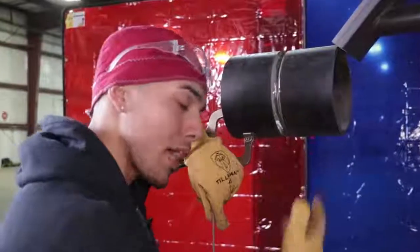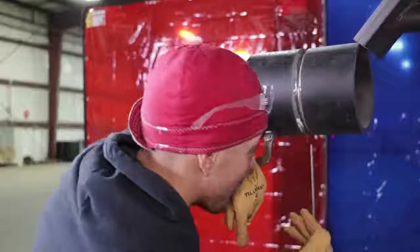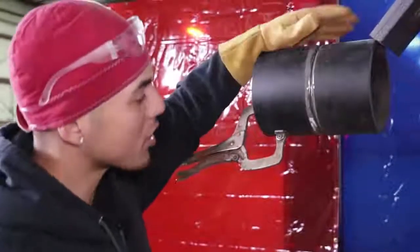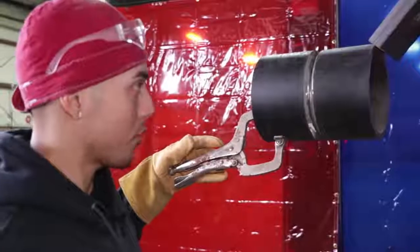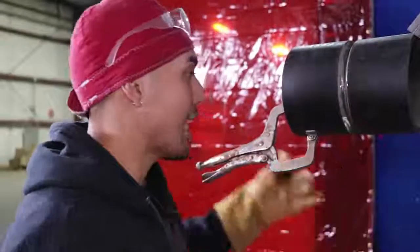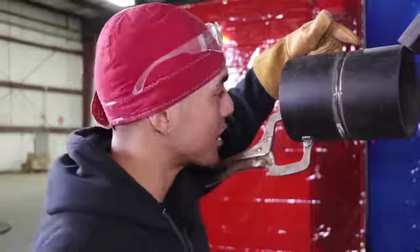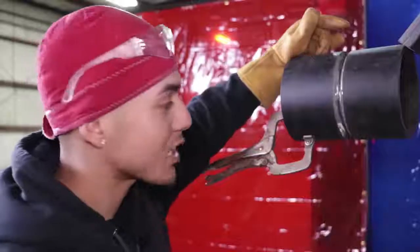But at first, when we're welding this root pass, you want to be comfortable. We're going to weld it from the bottom up, with a 3/32 gap and 3/32 landing. I have two tacks — one at 12 o'clock and one at 6 o'clock. You could put four tacks; I recommend two. I like to quarter it: 6 to 3, then 6 to 9, then 3 to 12, then 9 to 12. That's my personal preference, but there are other ways — you can put four tacks by all means.